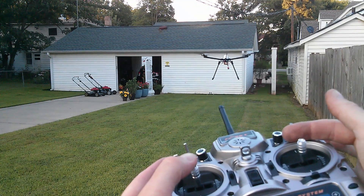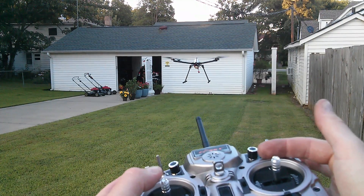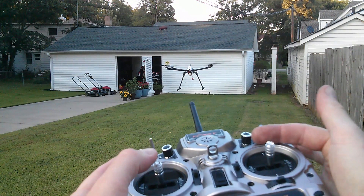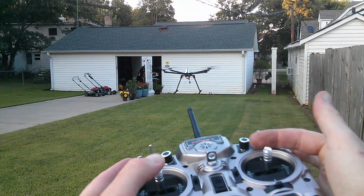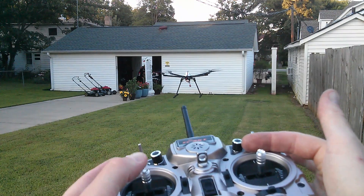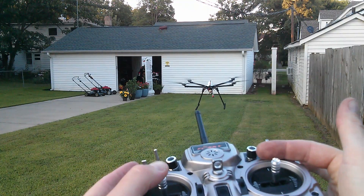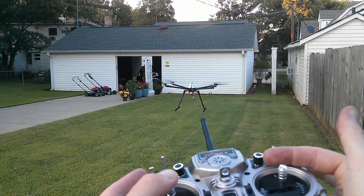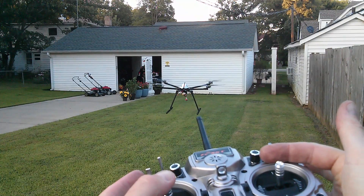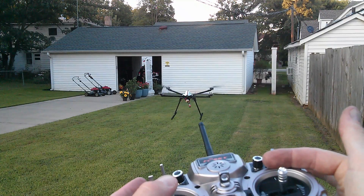It's really light. We made it to carry some weight, and we're just using a 5-amp pack. The cells were reading around 4.10 volts each — could have left it on the charger a little bit longer, but we didn't max it out. We've got an external lipo alarm on it, so we'll just run it until it starts beeping. See how it cradles when it adjusts? It's kind of rocking rather than moving several feet, which is good.